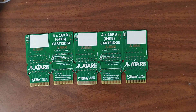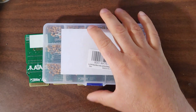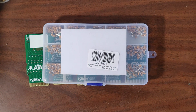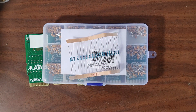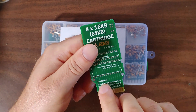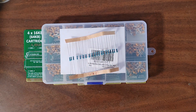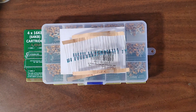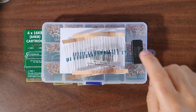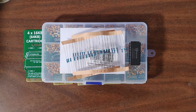Here are the cartridges I've gotten from PCBWay, and these are the parts that I need to build them. I have my ceramic capacitors — I need a 100 nanofarad and a 100 picofarad. I need two 10k resistors. And it's not actually on the list, but if you look on the board there is another resistor that says 2k2 — I'm going to assume that means 2.2k, so I've got some 2.2k ones. My 27C512 programmable chip, and it's also got a socket, and the DIP switches that I'm going to need.